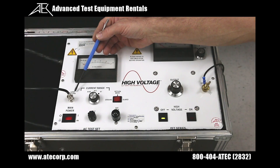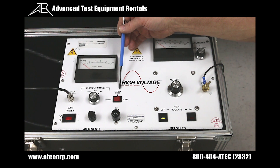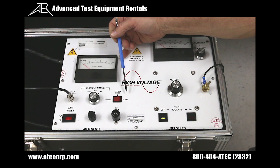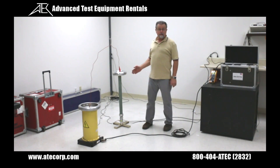The load return cable is connected to the low side of our test instrument. Our ground cable is connected to ground and our return mode switch — in the ground position, all currents are measured, and in the guard position, all currents are shunted to ground. To utilize this test, you must provide your own cable connected from the high voltage output to your test instrument.